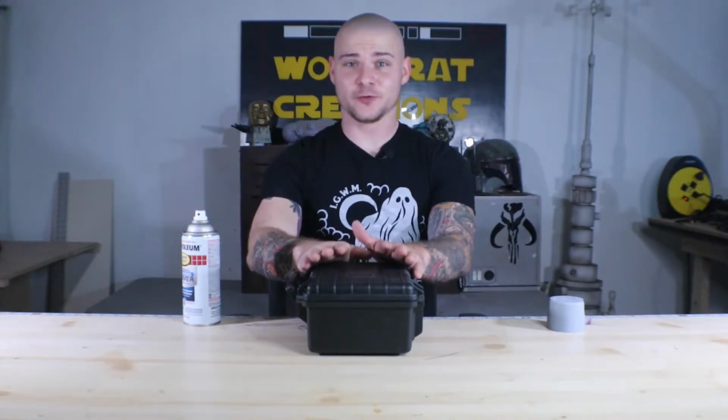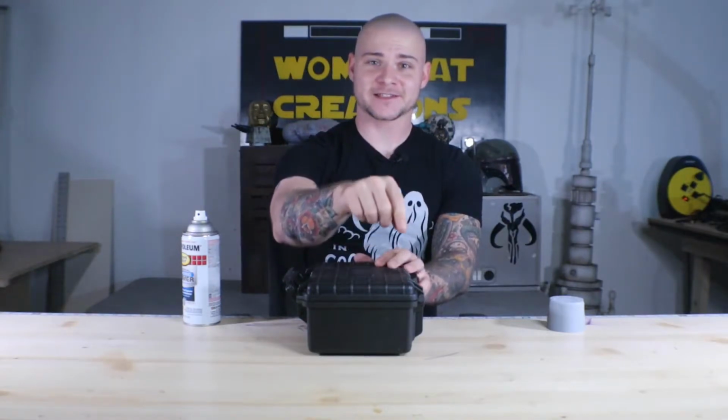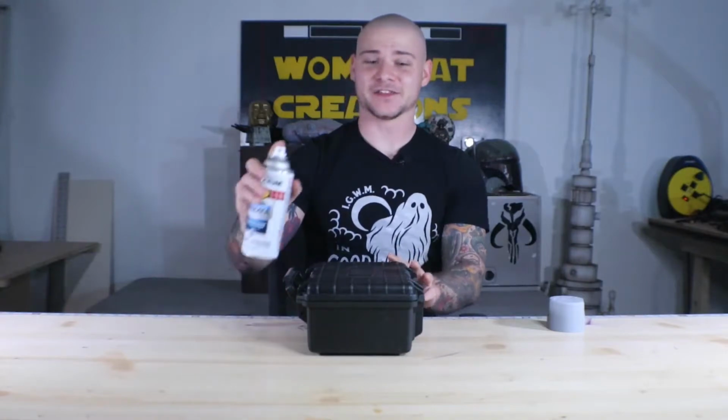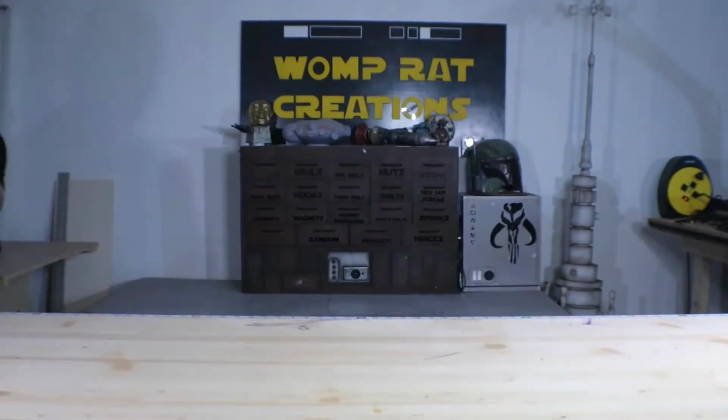You waste a little bit of paint doing this, but when you start on the object, it pools very quickly and you can get runs and all kind of nasty stuff like that. So like I said, you're going to start off the object, spray over, off.